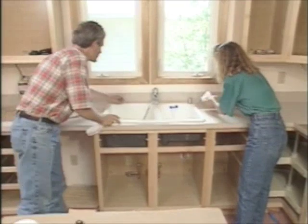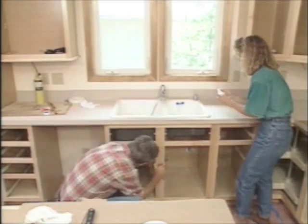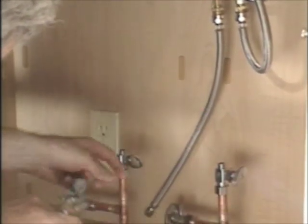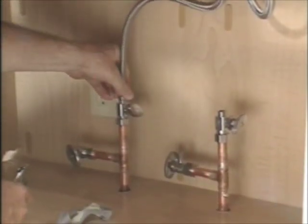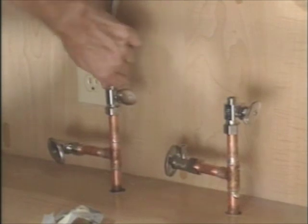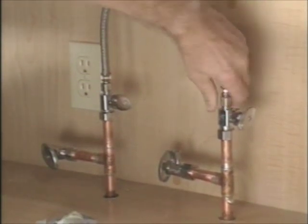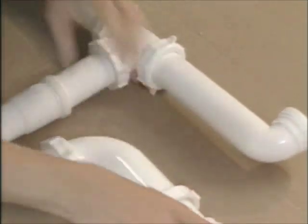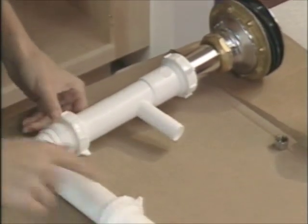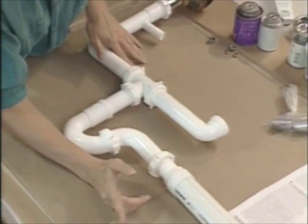I'll also be putting a bead of caulk on the outside here for a little added protection. Right now I want to hook up the supply lines down here. Usually you hook these up before you do the trap, otherwise the trap just gets in the way. There are a lot of different sizes and types of supply lines, so you want to make sure you know what you're dealing with before you buy anything. These are threaded fittings. For a kitchen drain, you generally end up with the sink drain with the tailpiece coming down, a special fitting for the dishwasher drain, a fitting for the disposer with a tee fitting going down to the trap assembly — required on every drain — and that goes to the stub out, which we held off gluing until after the cabinet's in.